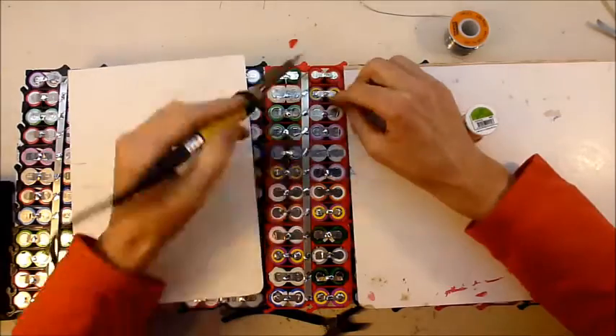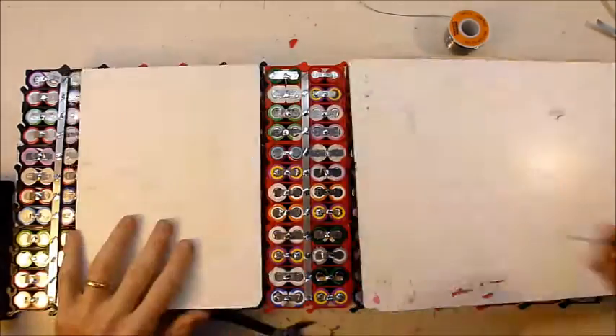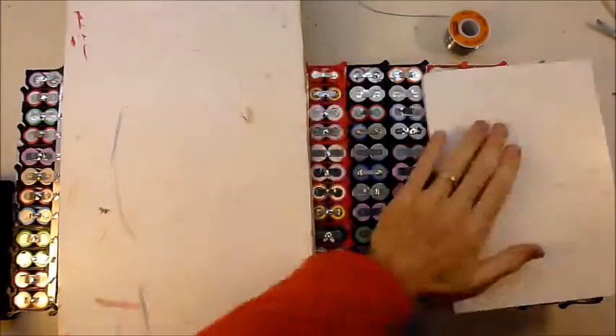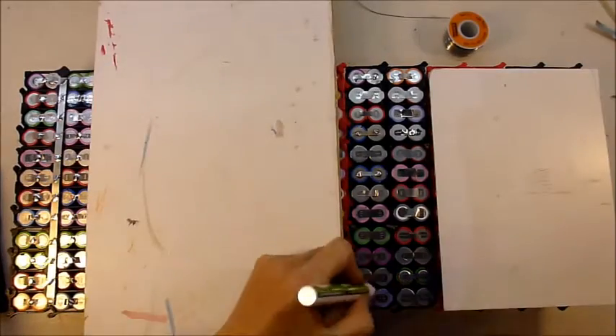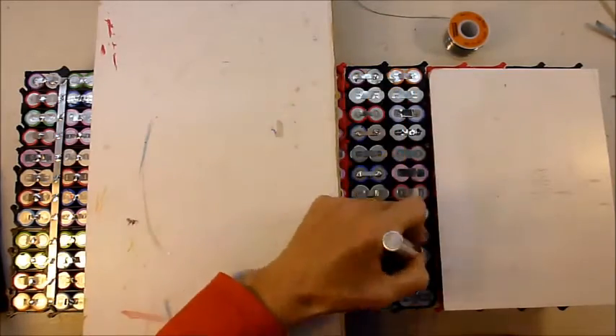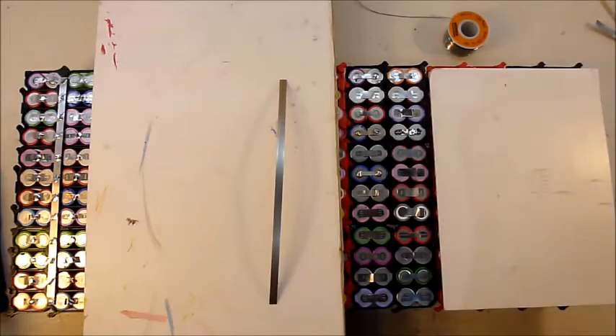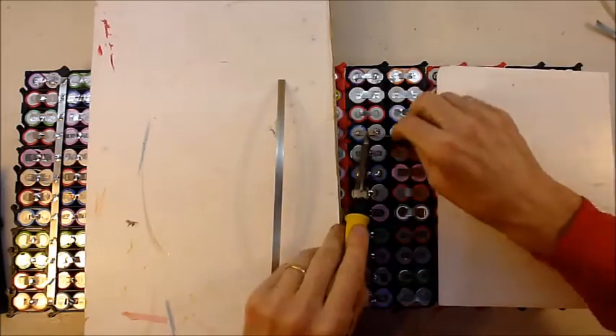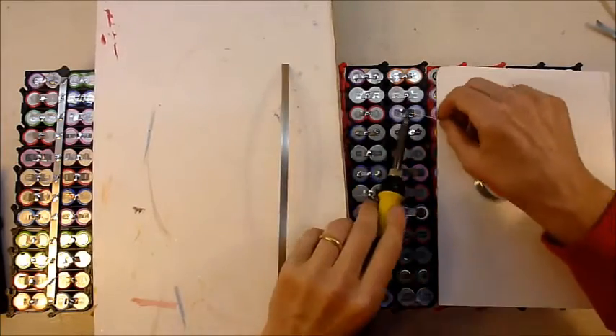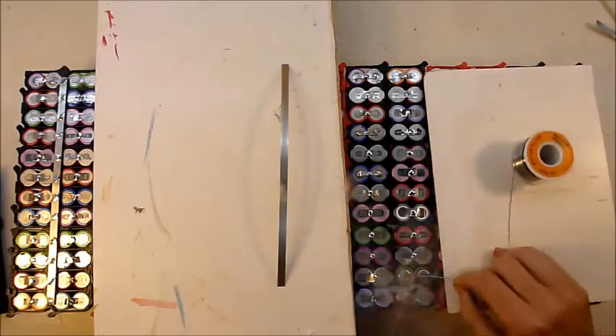It just saves a lot of time and it doesn't seem to gain all that much. I've got a link in the description below to a YouTube clip by MJ Lawton who talks about the difference between charging batteries in parallel and charging batteries in series. It's when you've got batteries in series that things can go out of whack. When the batteries are all soldered in parallel, generally there's not a problem.